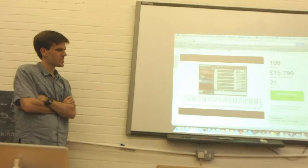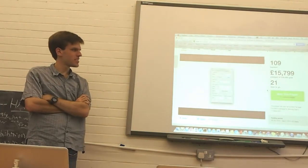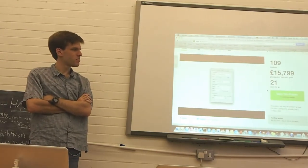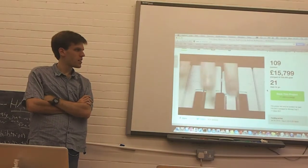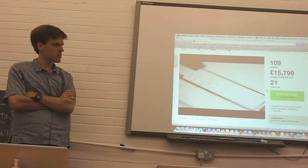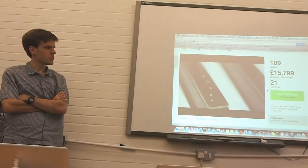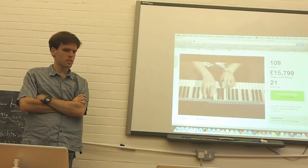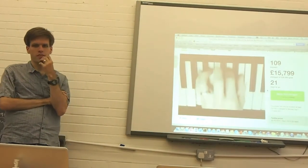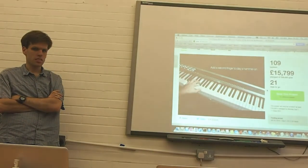The Touchkeys software works with any program that speaks MIDI or OSC. You just select the Touchkeys sensors and the MIDI keyboard that they're installed on, hit start, and away you go. The software lets you map your finger position and the contact area to virtually anything you like. Examples would be vibrato by moving the finger back and forth, pitch bends or control changes by moving the fingers up and down, or extended techniques by using two or more fingers.